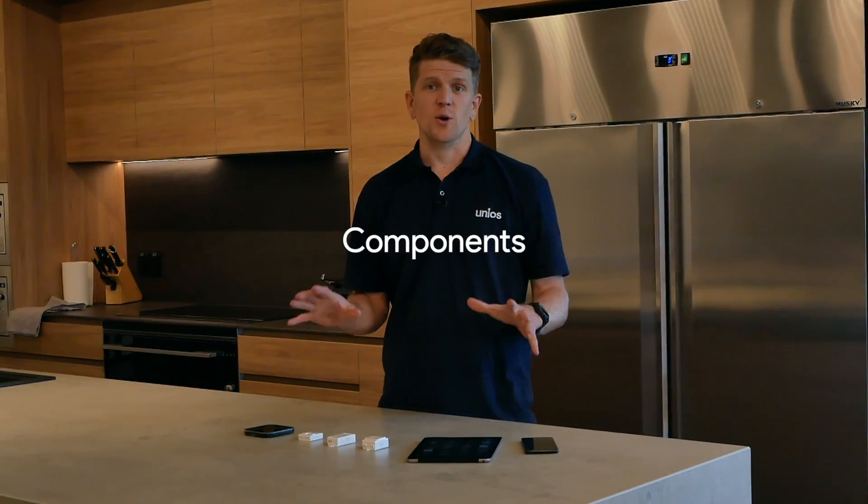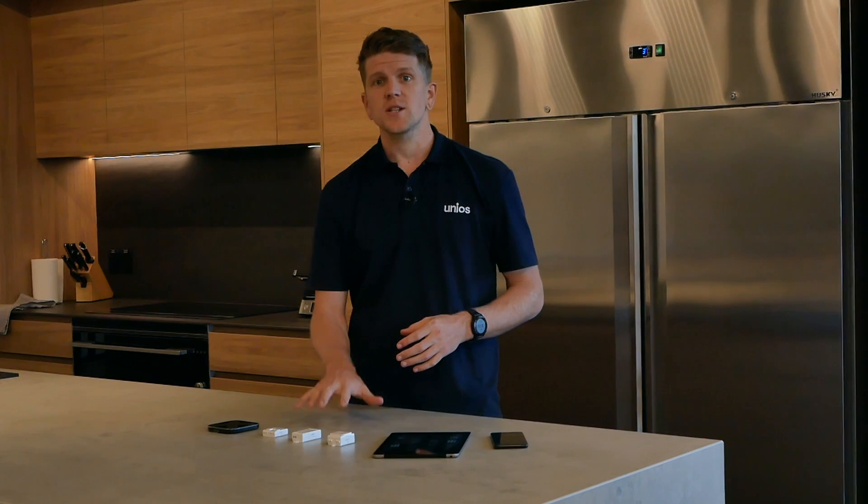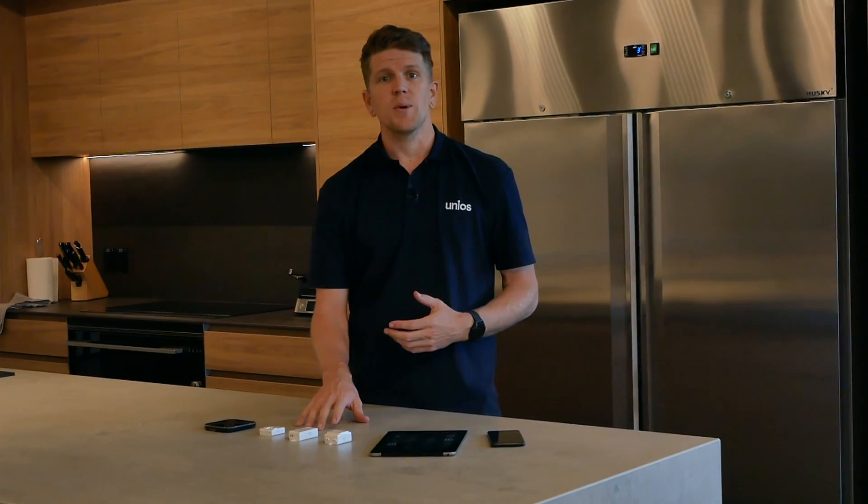So these are the components required to get your system running. You can have as little as one unit and any smart device, or we can pair hundreds of units with various switches — whether it be the express switch, bell press modules, or even 240 volt switching. The three types of receiver modules we have are the trailing edge phase cut, the PWM constant voltage unit, and the ASD. The ASD can be paired with tunable white, RGB, and DALI drivers, just to name a few.